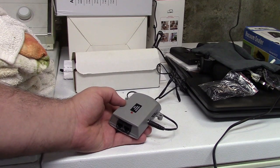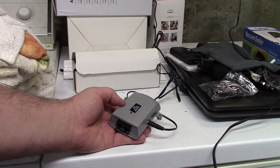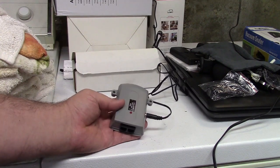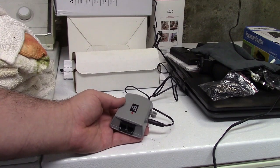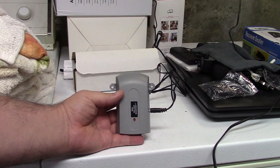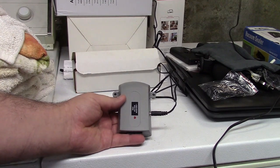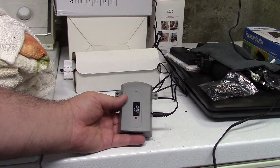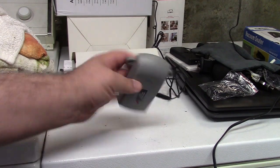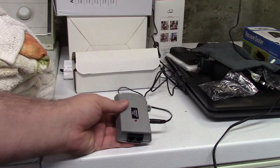If I disconnected the rest of the house from it, then it would work. So I just want to give a quick demonstration of what it was supposed to do, now that I have my issues resolved. The reason this didn't work, as far as I could surmise, is because it simply did not produce enough REN with its rather dinky power supply and circuitry.